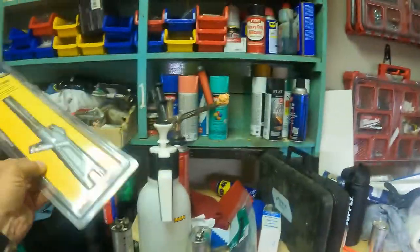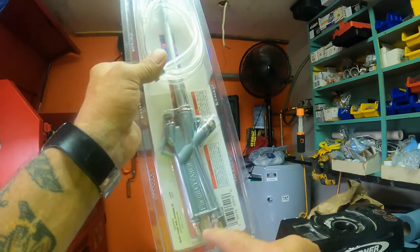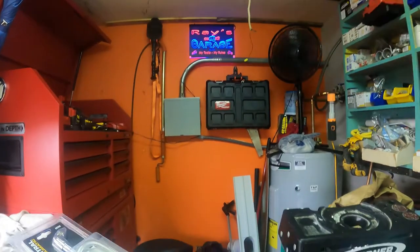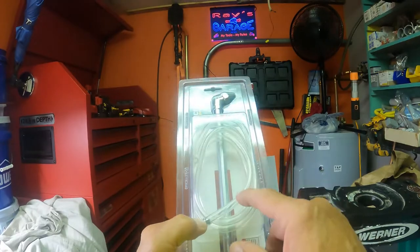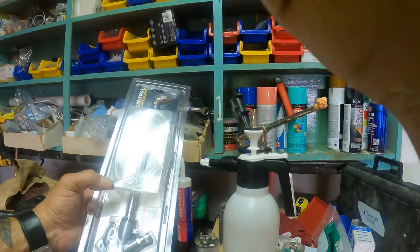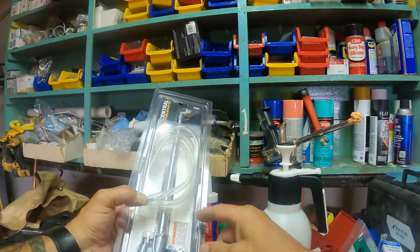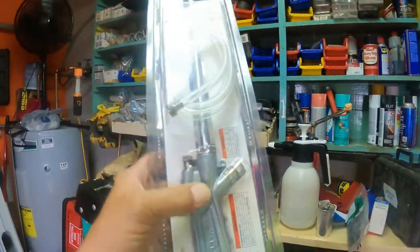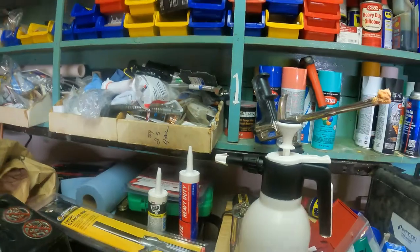Hey, check this out — my mind's always racing. It comes with a hose and it attaches down here. You hook an airline up to it and I could use this for spraying inside of the coils on these furnaces, because they're so bad. Here comes a little filter on there — how about that? So I can drop this down in a bucket, or my spray bottle that has the chemical for cleaning the coils. I can just put this down in there and spray water through this onto the coil with a little bit of high pressure. I hook that up to the nitrogen tank, I get my high pressure, and it'll shoot right through the coil and clean it up better.